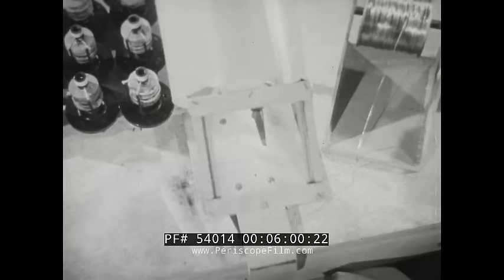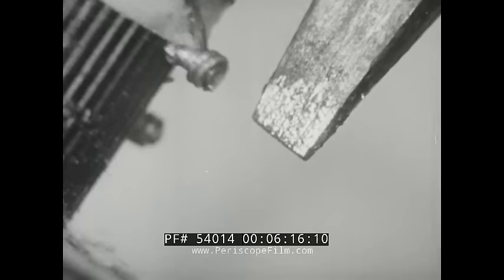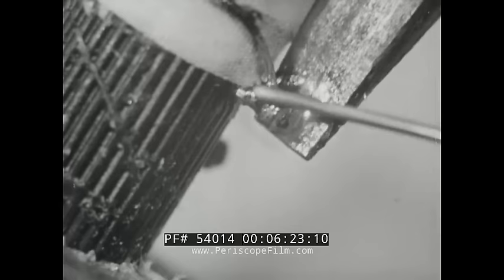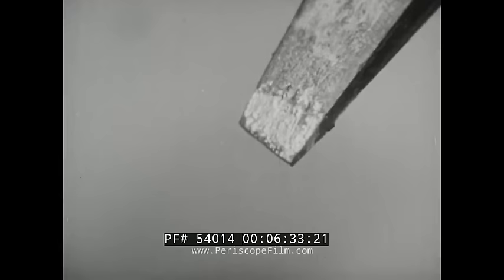The joints are now ready for soldering. A plate glass shield protects the eyes from fumes as well as splatter. Test the heat of the iron by touching the tip with solder — the flux and solder should melt instantly, but the rosin should not char or burn. Now place the joint to be soldered so that the wires lie flat on the face of the tip. Feed solder to the iron for a little pool or trough to aid the conduction of heat, then touch the solder to the wires. Avoid an excess, but make certain there is enough to flow evenly throughout the joint.